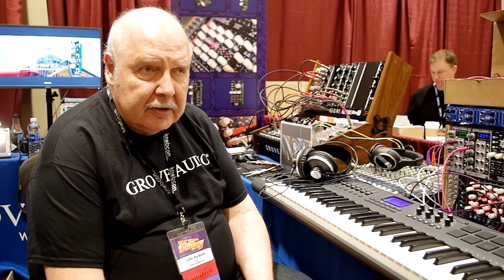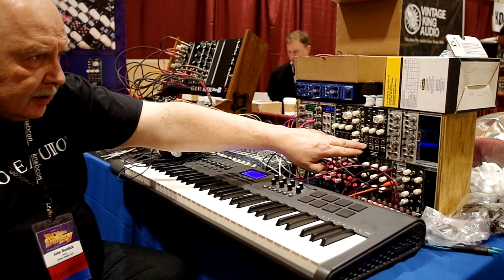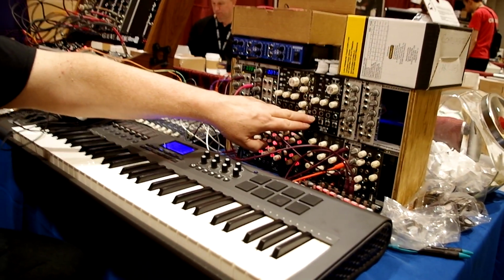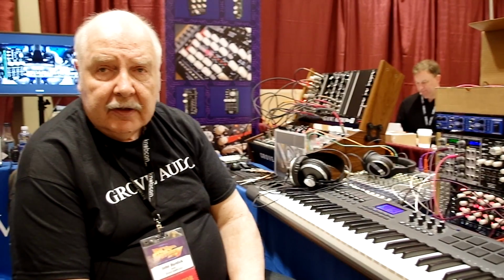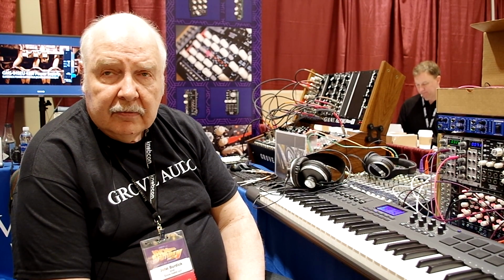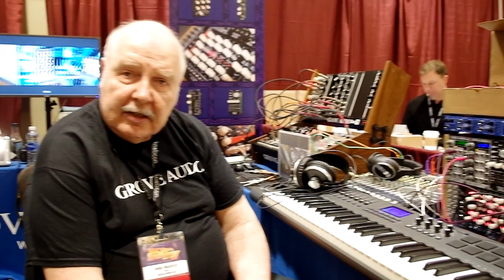Well, we've got some new Eurorack modules too. This year we're going to be getting this through zero oscillator out. It's a through zero digital oscillator, and it is both FM and PM. So it's a little different than the conventional ones that you see, in that it will do phase modulation also. The advantage of phase modulation, of course, in a musical setting is that it doesn't go out of tune as you vary the amount of FM modulation that you're inputting, because you're only changing the phase, which in mathematical terms is roughly equivalent to changing the frequency, but with maintaining a constant carrier frequency.